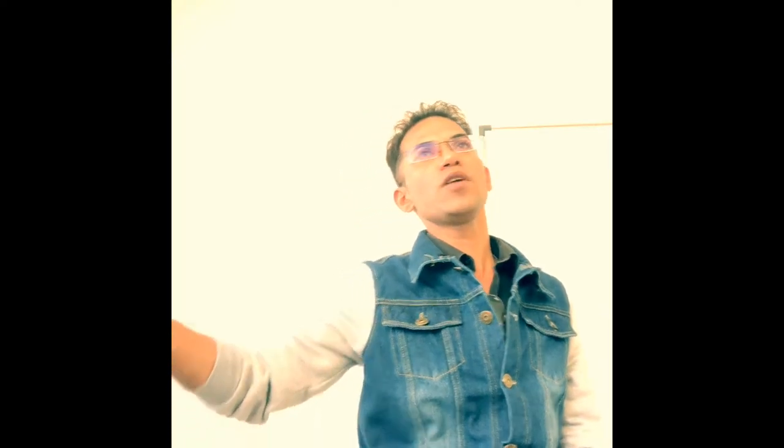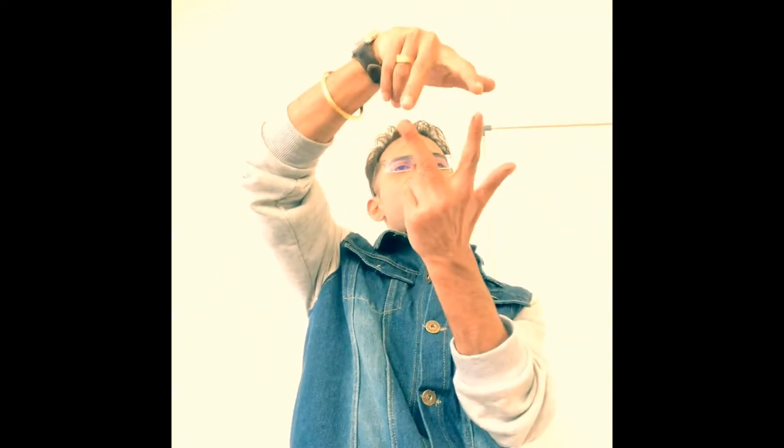These grooves enable dividers to be set to a greater accuracy, as the divider point can be felt to drop in the recess. Here they have also mentioned the use of recess in terms of the divider. If you are using a divider to transfer the measurement from one point to another point, you are taking measurement here. Now this is the measurement you are hoping to use to cut a metal piece. You need to transfer this measurement from this place to the actual piece where you need to cut it according to the size. To transfer this measurement, you are taking the divider.